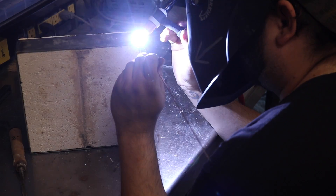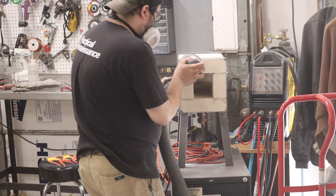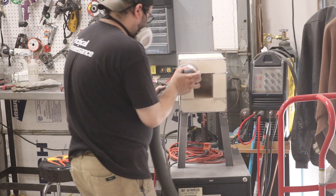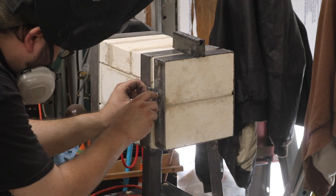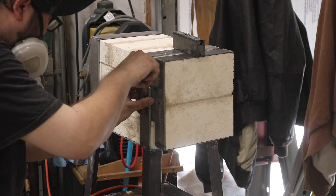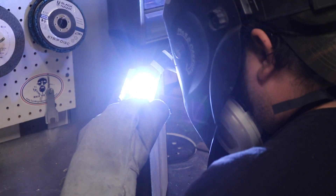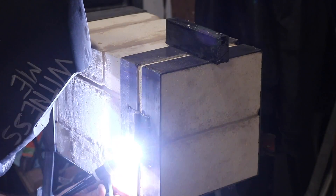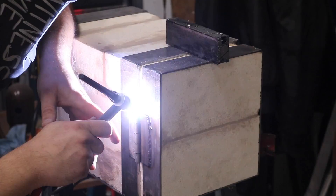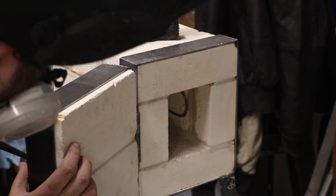The door is as simple as two bricks mortared together with some frame around it as well. I evened up the front of the oven just with a palm sander and a vacuum — making a terrific mess, but I got it nice and flat to meet up with the door. The hinge is an uncoated plain steel hinge I got from my local metal supplier. It seemed pretty heavy duty, but once I got it in place it allowed for a little bit of sag. Two hinges would have been more ideal.